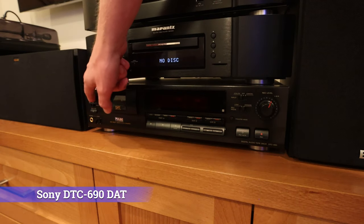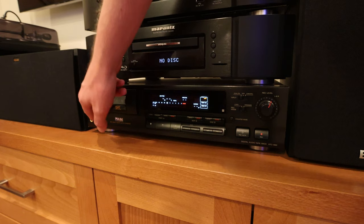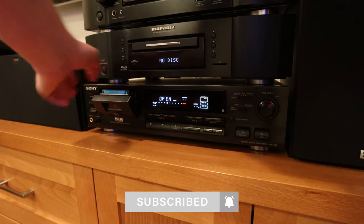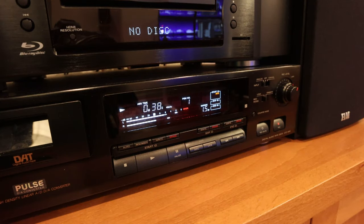Next up is perhaps the first interesting component in my setup. This is a Sony DTC690 digital audio tape deck. For those of you who don't know DAT, this is a format that holds 48 kHz, 16-bit stereo audio on magnetic tape. This is a really fascinating format that exceeds the specifications of compact disc. I have an older video on my channel where I was actually able to encode HD video into the audio portion of this tape format.